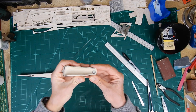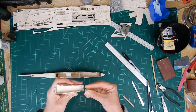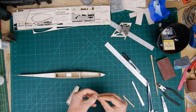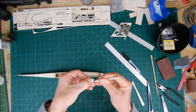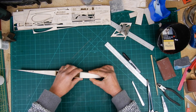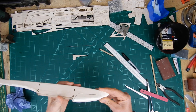So I have my magnet — I've just ground a very small hole so it fits nice and flush. Make sure you've got the magnet in the right orientation, otherwise it's going to spoil your day if it goes in the wrong way. I've got that marked and I know which way round, and I've also marked it on that magnet as well. I'm now going to use some aliphatic glue — not super glue because it will go off too quickly. I'm going to add some wood glue either side, feed it into this slot, and then add my canopy like so. And there you go — that's one hatch stuck down with the magnets.